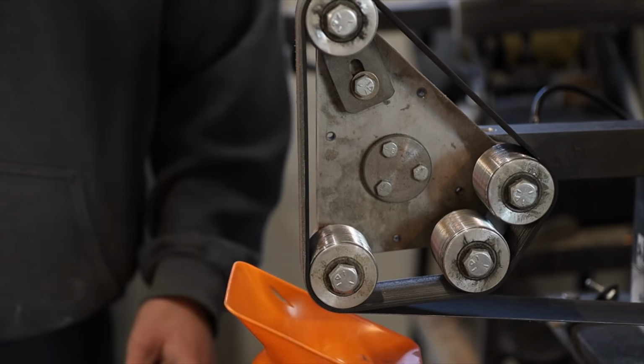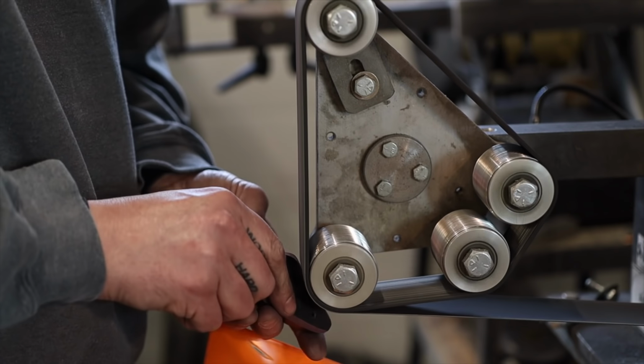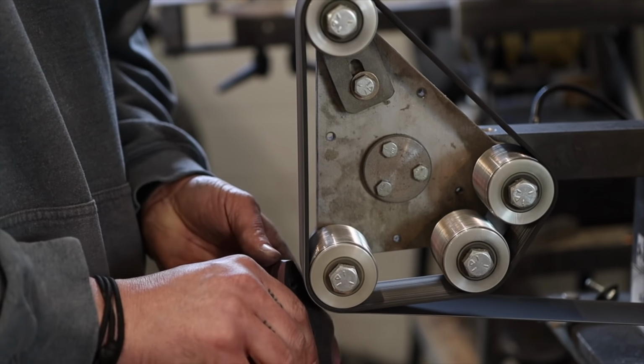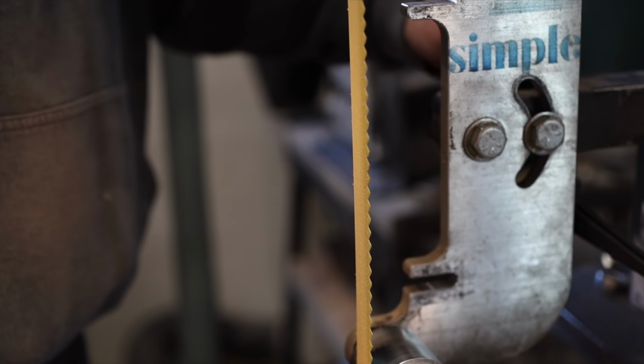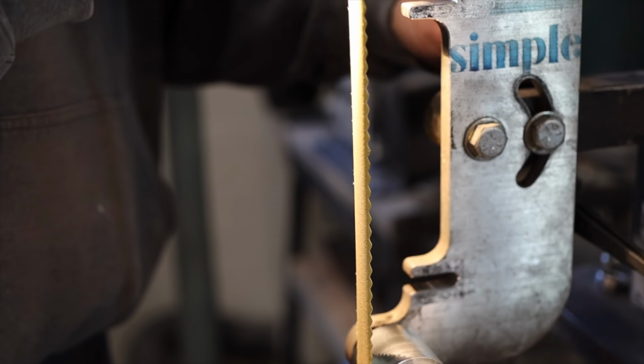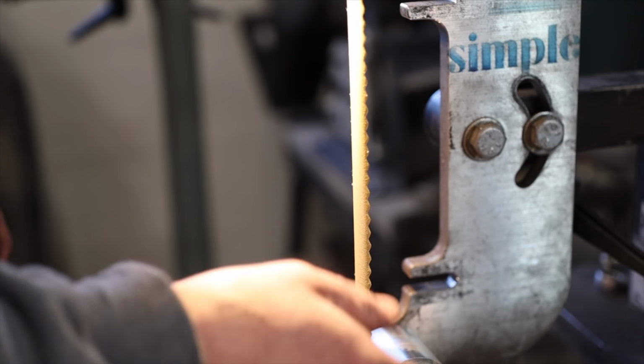And now that we've got the handle profiled to the tang of the knife, we'll start putting in some ergonomic grips, mostly just rounding things over. I like to start at 45-ing everything, getting the mass of the material gone, and then start blending it.